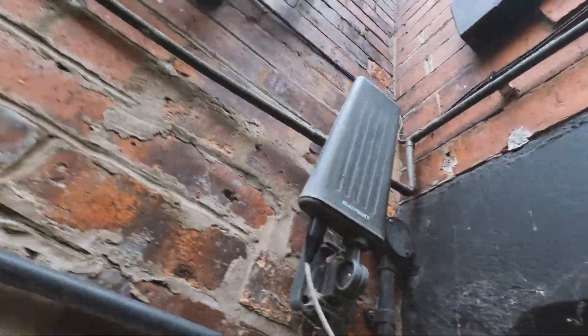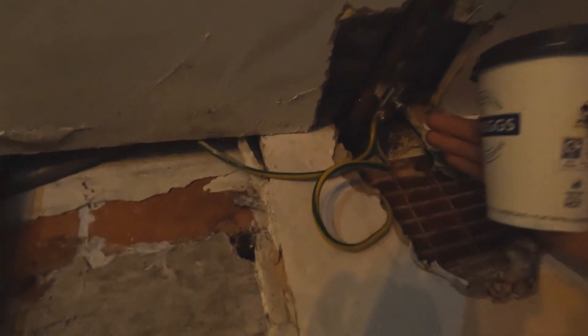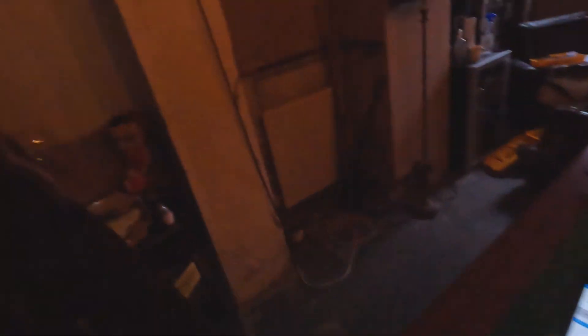Should be an interesting one. I can see the gas line coming in - that's the gas line there, the other side of that is the gas meter in the street. That's all bonded up, so we'll check that. However it hasn't got its label on, so that'll go down as needing a little label saying 'electrical connections' - that does need to be on there.